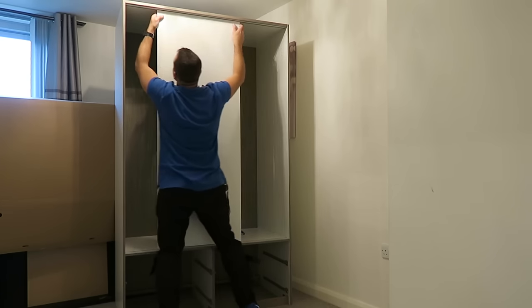Drawer handles: two screws through the drawer handles, joining screws through the inside of the drawer. Place the door handle and secure it with two screws — it's a bit annoying and quite hard to get into those holes, but once you get in just put them through and secure with the joining screws. We can position the drawers — two at the bottom. If you need to adjust the legs you can just unscrew them depending on your floor.